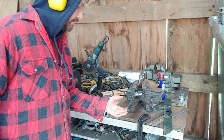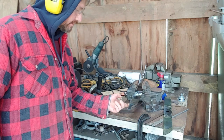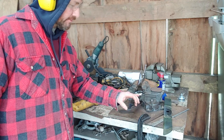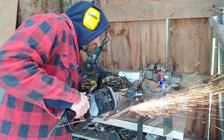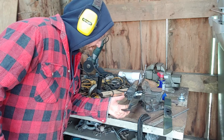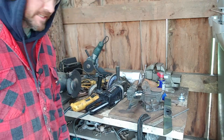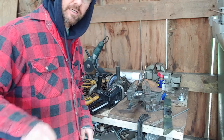We're going for a burr — not there yet, I want to get past those chips too. I've got a good burr going on the riser part here, so that's all set. There is a little chip right there that I'm not going to worry too much about. Most of the cutting action is going on right at the tip of the blade, so that's definitely a place to focus on — it's also the indicator of when the blade is ready to be replaced. Good burr going there; that's actually all set. The blade does get kind of warm, so watch your fingers.